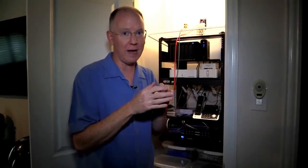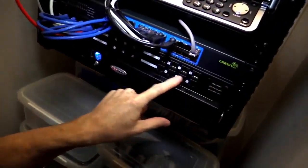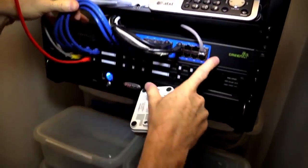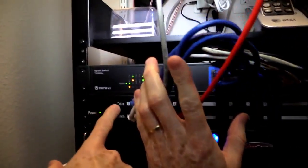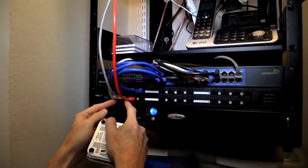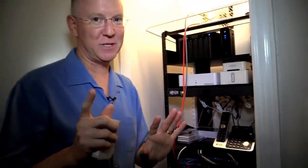However, in order to only use an Ethernet cable, you have to be able to put power into the cable. There are two types of Power over Ethernet: passive and active, and there are some standards and then some people don't use standards. This one is not really standards-based, so you can't just go buy a switch that has Power over Ethernet and plug it into these — that does not work. They even warn you about it when you take them out of the box. What you need to do is get a POE injector, and OpenMesh happens to sell them.